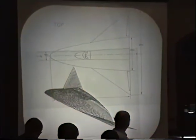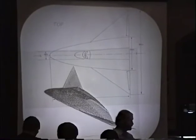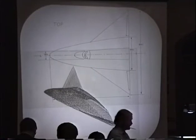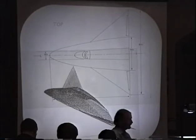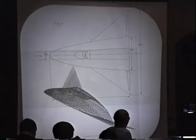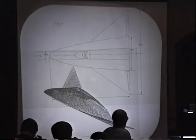And then that ran into a number of problems, including the re-entry. After everything else had been eliminated, we pretty much ended up having to do a lifting re-entry, and just couldn't get high enough lift-to-drag ratio on that. So it's a lifting body design, which you see right here. This one still has the best aerodynamics of every design we have here. It came out with the best lift-to-drag, the best flight characteristics. It had only one problem: almost impossible to manufacture.